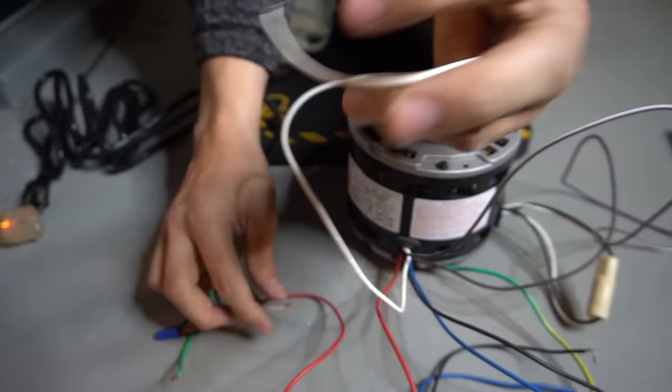The last one is the high speed. On the high speed you can actually hear the motor running louder — with a blower wheel this would be much more pronounced. The amp draw on the high speed is substantially more than the other two speeds — 6.0 amps. So for air conditioning there's a lot more amp draw.